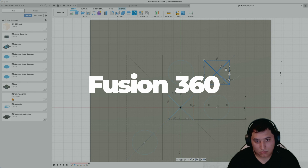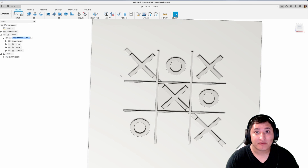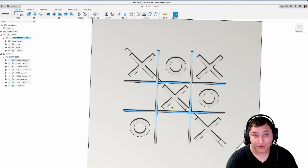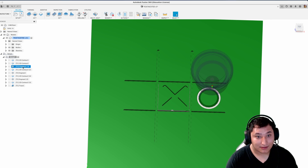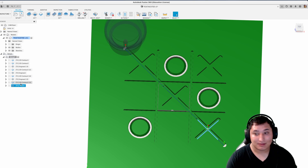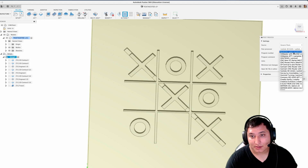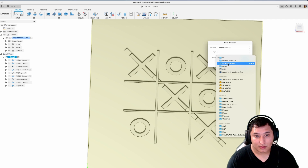Let's go ahead and jump onto Fusion 360 so we can begin modeling our test file. Before we finish installing the hardware, we're going to design a print for the CNC so we can test out the tool changer and make sure everything is looking good. Let's make something fun — I'm going to make the CNC play a game of tic-tac-toe. This will highlight changing all of the multiple tools. We're going to separate each operation as a move. The CNC will begin by making the tic-tac-toe board, followed by an X, then an O. Meanwhile, it's going to be flipping tools. Let's go ahead and export out the G-code. I'm going to select the post processor — RepRap Firmware. I'm going to name this program Tic-Tac-Toe and save this on my desktop.